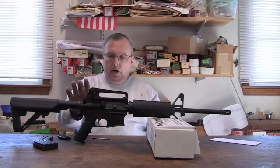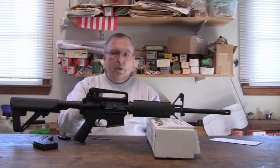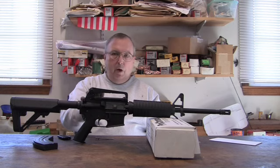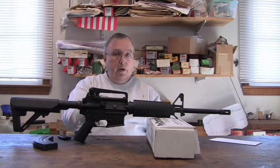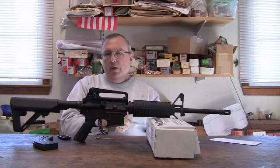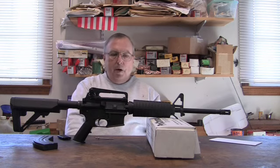I hope this video helps. We figured out the firing pin needs to be longer. With certain brands of ammo like Wolf, it has to be even longer than the enhanced version. I have no problem with better quality ammo using the enhanced firing pin — the strikes were normal, everything went off, everything looked good, the primer struck correctly, nothing got pierced. So even if you added another ten thousandths in length to run with Wolf on top of the enhanced pin, I don't think there would be a problem. Firing pin problem resolved.